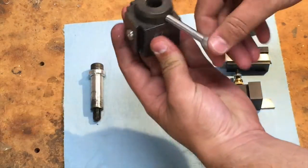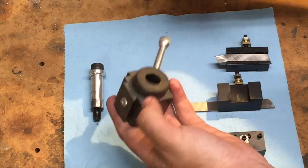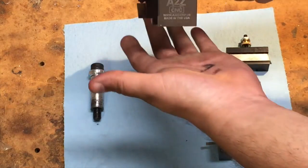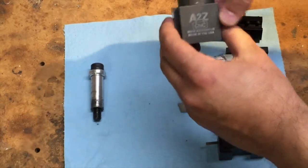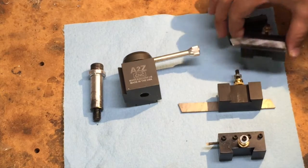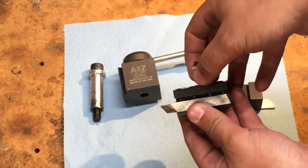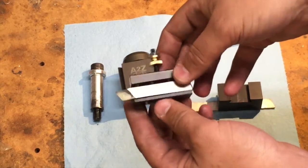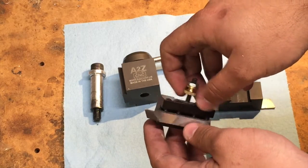It has this lever that operates these two pistons on either one of these rails that the individual tool holders slide onto and lock in place. Not only is that handy for changing out tools quickly, but the biggest reason I find this helpful on a lathe such as this is that you can adjust the tool height just with these knurled thumb screws and a little locking nut.